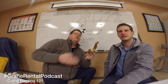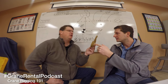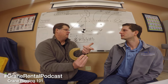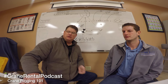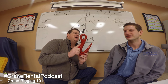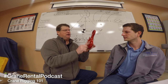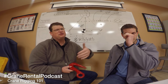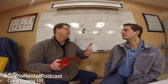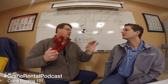The other hook I wanted to show is a foundry hook - there's no latch or keeper on it, so when you let go it falls off. Think of an application where you need to derig without getting in there - like a foundry with molten metals, or a nuclear facility where you're dropping bags into a hole and you don't want to be next to a nuclear drum. It has applications. But you've got to remember these kind of hooks are what they call 'not for overhead lifting.'